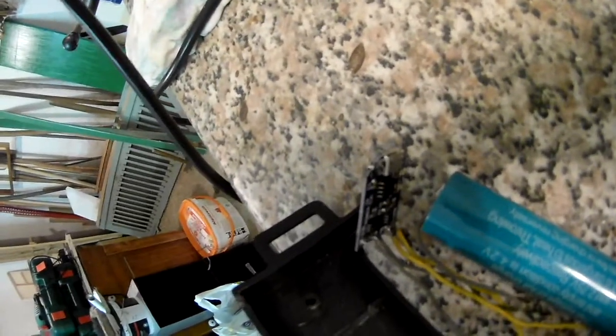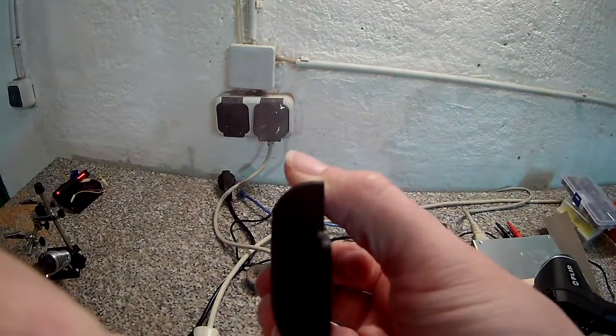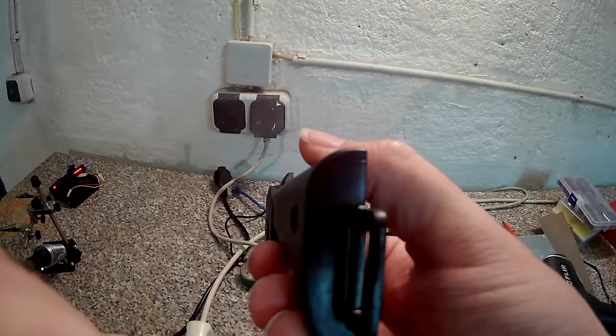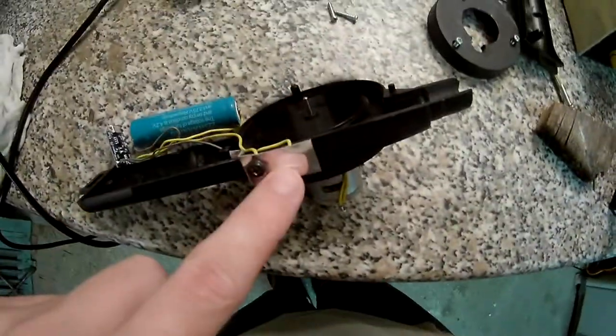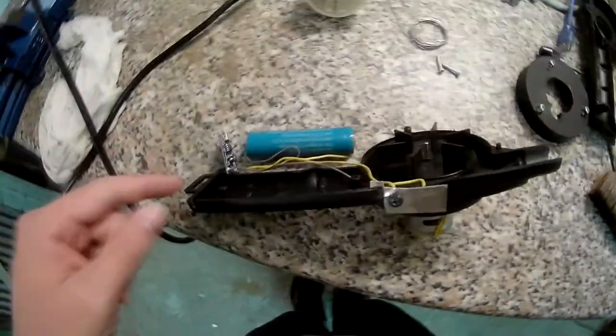So I guess I have to replace the board and check if I can get it in there without sanding it. Looking at this case it's obviously round, and having a rectangular PCB in there isn't great. Maybe I also broke it from flyback off the motor — who knows.